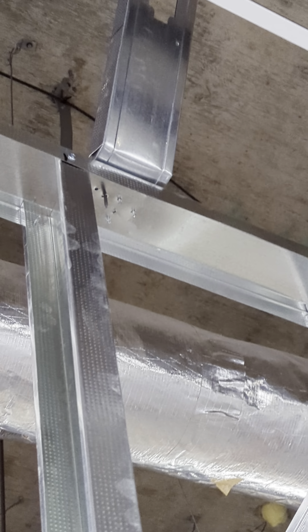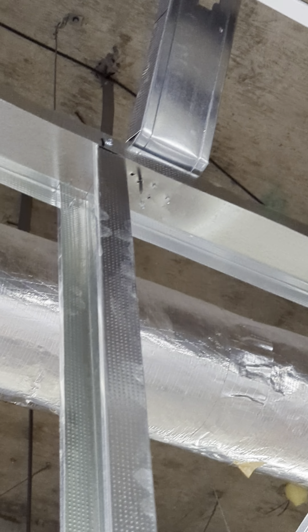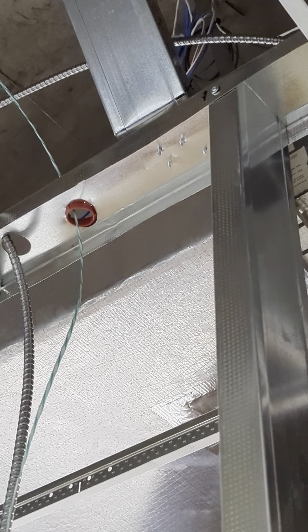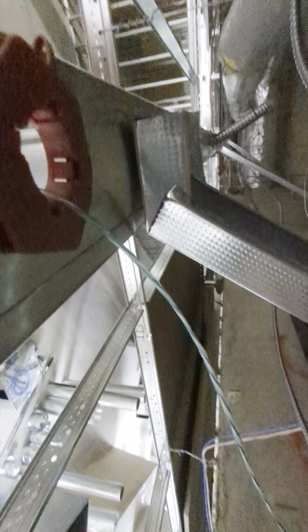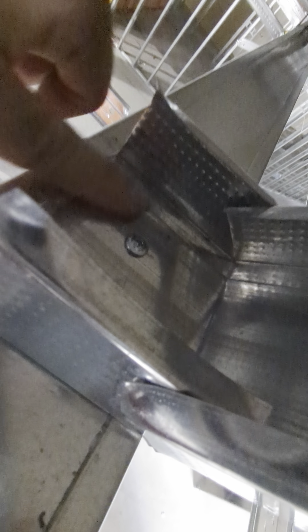Another cause of that — this is a better example. The elbow, or the connection point that makes a kicker strong, is outside the wall. It's above the grid, so that's not a big deal, but the fact that the screw is way over here and not where it needs to be means that when you move the wall, see how it picks up and it bends? So now that we're up here on the wall, when I move this, the whole thing is picking up. You can have a hundred screws right here — in fact, they've got four screws right next to each other — but they're not where you are trying to hold the wall. The screws need to be as close to this elbow as possible, because that is your hard point.